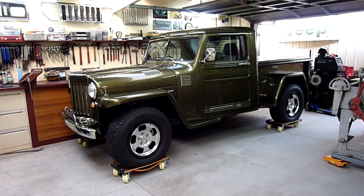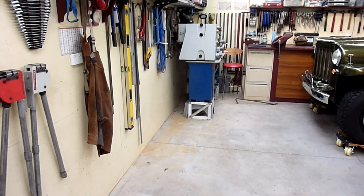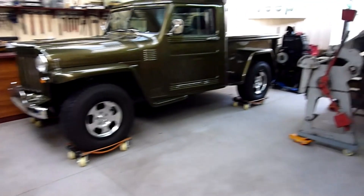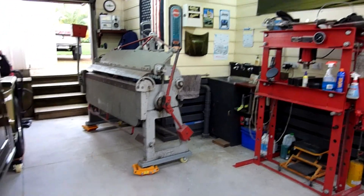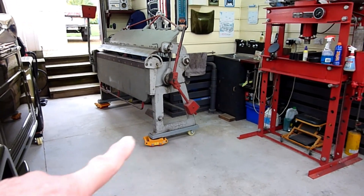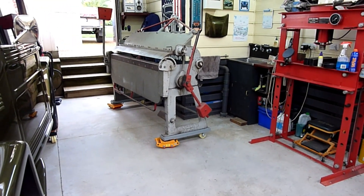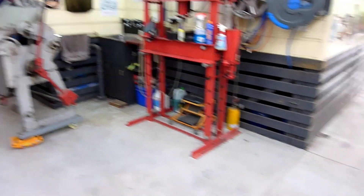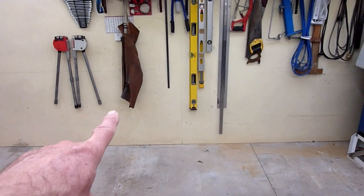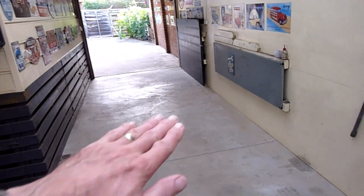It's up on skates - moving day! As you can see, the folder rolled quite successfully over into this corner here. It weighs two and a half ton but it rolled well. The only issue is you have to rotate these skates; they don't self-center in the direction you want to go, apart from the back legs which are fine. That's why I made the pull hooks - so that gives us a lot more clearance past this corner, because before when the folder was right along here I could not line up the truck in a straight line.